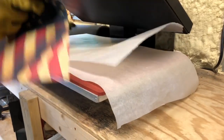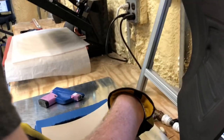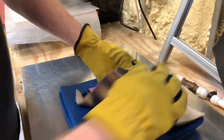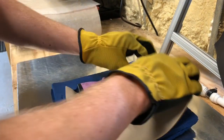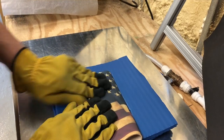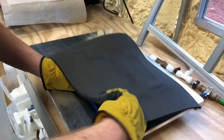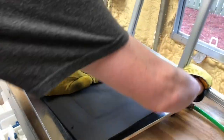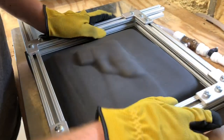The Kydex is hot. Pull it out, making sure that there is a hole placed over the center where the suction comes from the Swift Press. Just pull it tight around the gun there, lay down the thin foam that we have, and put that down to create the suction.